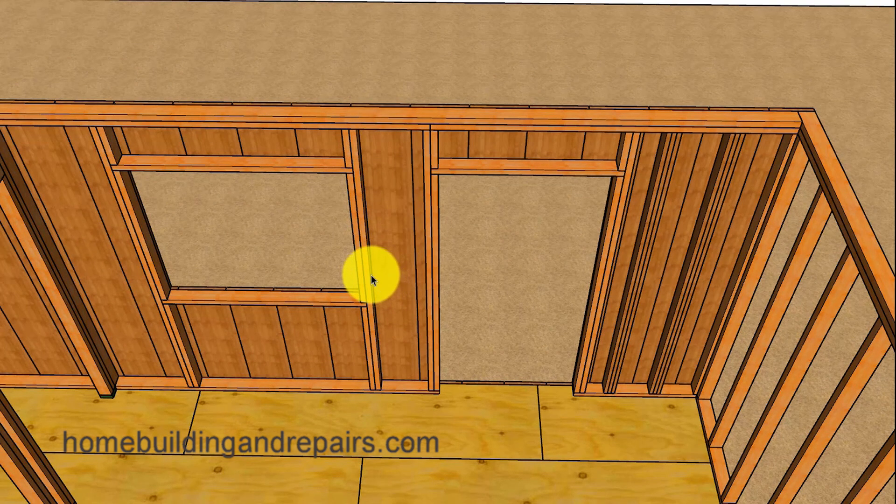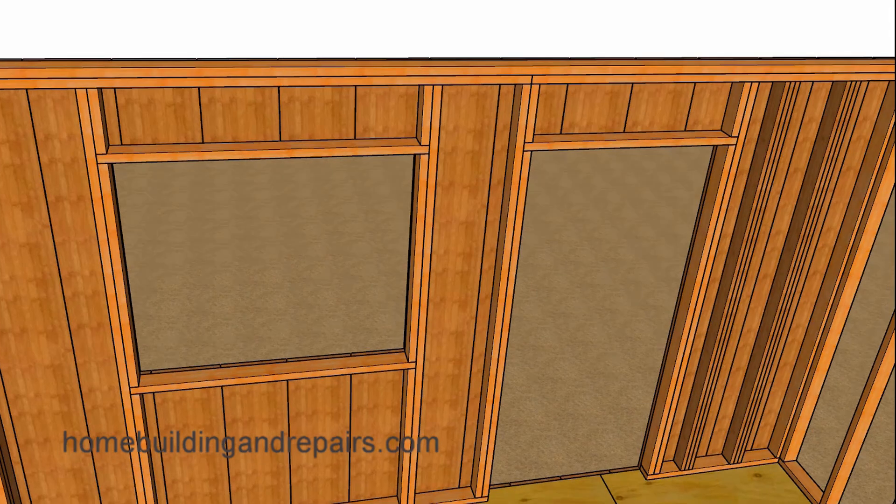I think the wall would have been even stronger if we had blocks in there, or maybe even a few more rows of blocks. However, once you start running rows of blocks you could actually take those blocks and install them vertically as solid pieces of lumber instead of cutting them into blocks to get a few more framing studs.